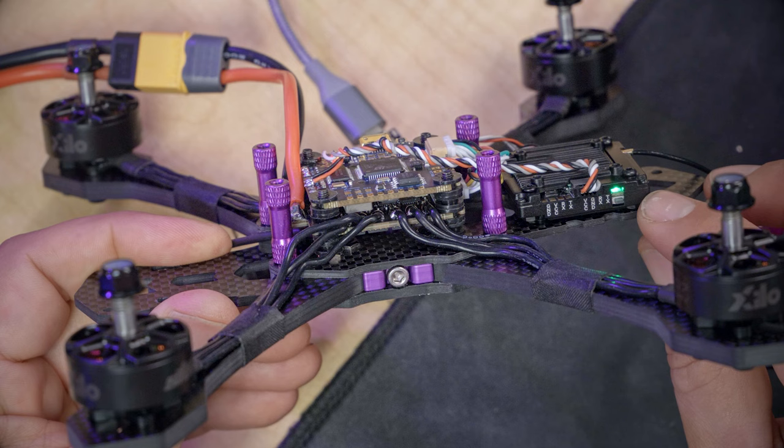When the LED on the video transmitter comes on and begins blinking like this, we're going to press the bind button one time. The LED will go solid red. And then we've got a firmware versions do not match, as well as, well, it should match. Let me do this check. Device info, 3237.10. The transmitter is 3339.8. Oh, well, that's very interesting.